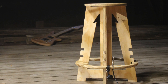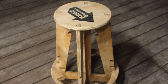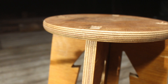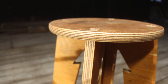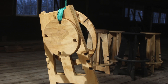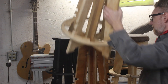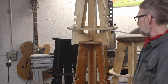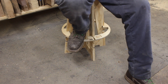One additional note: the holes in the top of the stool are still pretty tight. I used a rasp to clean up the inside and round it over — I didn't want to make them too loose, so just be careful when putting it together because you could split the plywood if you force it. A rope in the shape of a loop is all you need to carry this away. Oh — I also forgot to mention these stack really well.